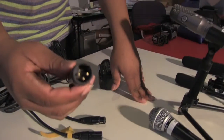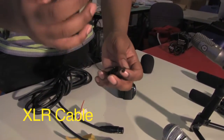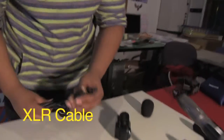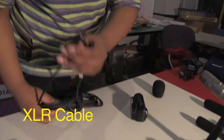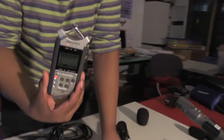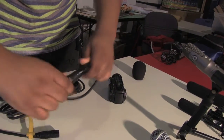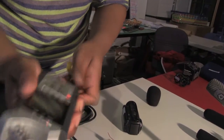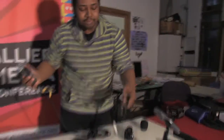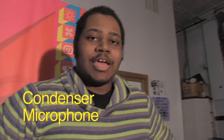Now I'm going to take you through the wired lavaliers. Instead of transmitting wirelessly, you have your microphone on one end that you clip to your person, and then an XLR input. XLR cables are professional audio cables you'll see on pretty much any professional rig or at concerts. With these, you only plug into the Zoom audio recorder. You connect it with a male-to-female connector and then to the Zoom, giving you extension between your talent and your recorder. Always plug your headphones into your Zoom to monitor how the audio is recording.